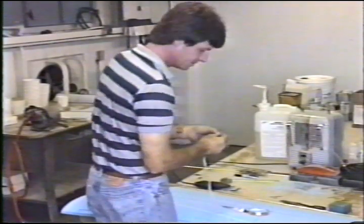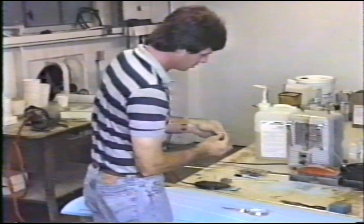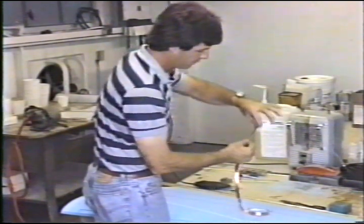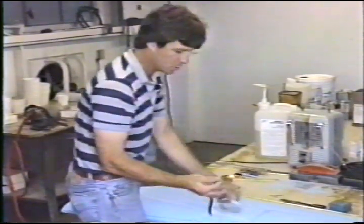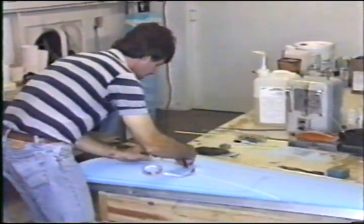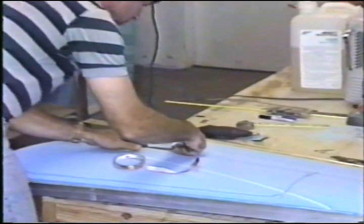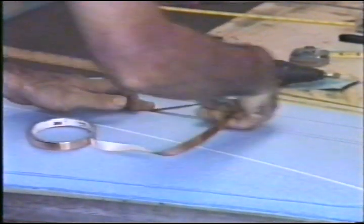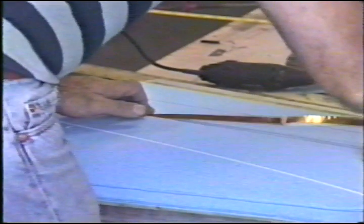And now we've got our coaxial cable set up with our toroid beads. We're going to take the adhesive-backed copper foil, 1/2 inch wide. We've marked the length and the perimeter. Put it between the lines, rub it down, pull the backing.